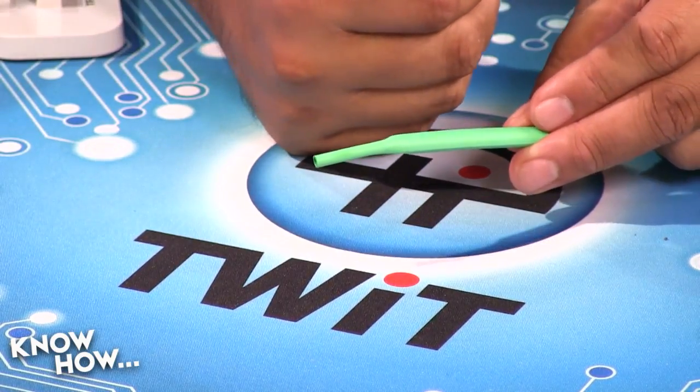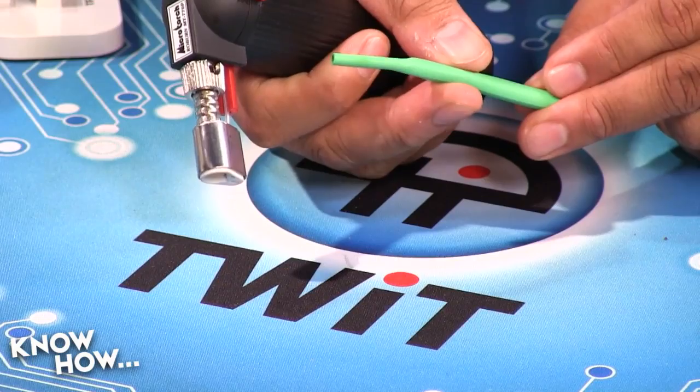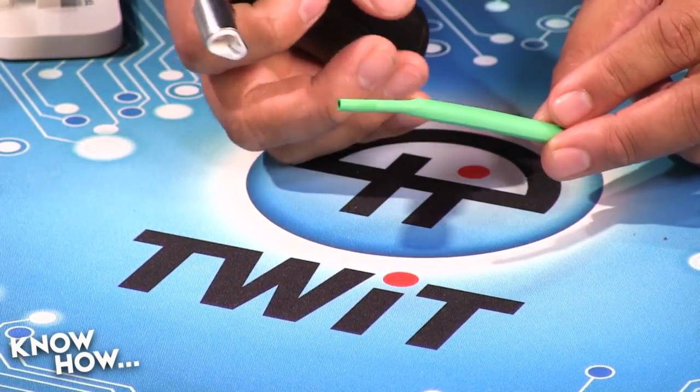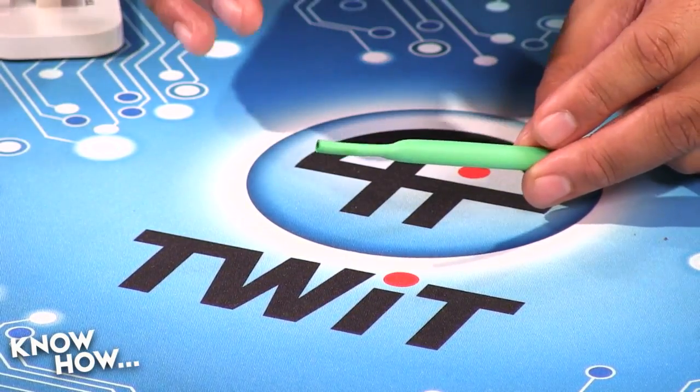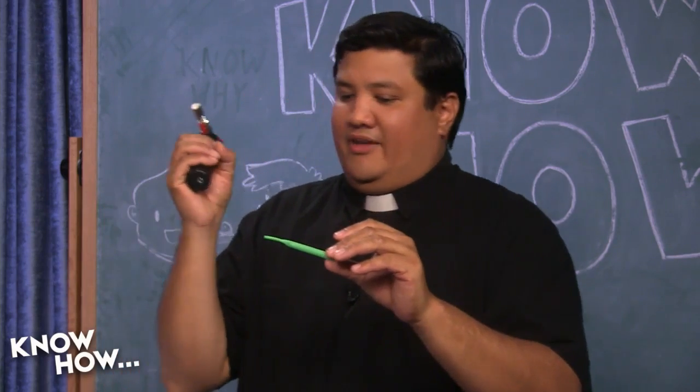So it's not just the solder joint that's holding those two wires together. Right. This can actually pick up quite a bit of the weight. Yeah. Now, for most applications, this is water resistant, not waterproof. I wouldn't want to put something that's been heat shrunk with this underwater. But if you splashed it, it should be just fine. There is enough adhesion inside the inner wall of this heat shrink tube that it should hold to both ends of the insulation. Okay, cool.